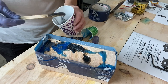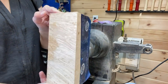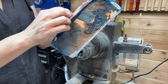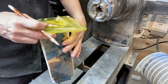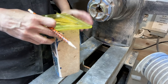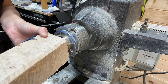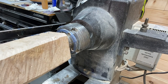It's hard to tell what colors are going to show through once it's turned, because I'm not even sure which side is up at this point. I'm taking the tape off and replacing it between centers, finding center. If you haven't tried this center-finding tool, it's very inexpensive and very handy to have around. I'm using a spur center in the chuck and a live center on the other end.